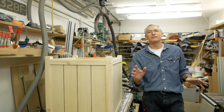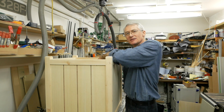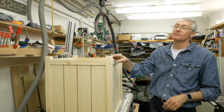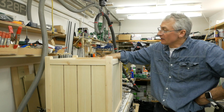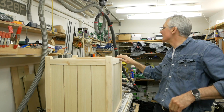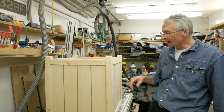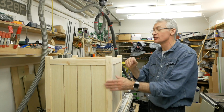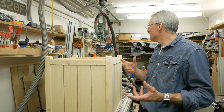Okay, now I do have a bit of a confession to make. I bought the timber for this little project about a month ago, 6 weeks, something like that, and it's just taken me this long to get around to doing it because of pressures of commercial work, you know, client work, and because of that, it's actually twisted a little bit. It's a little bit cupped here and there, so some of these joins are a little bit gappier than, strictly speaking, they should be. So I'm just going to bang a little bit of 2-pack resin filler into those.